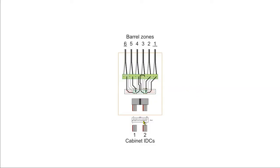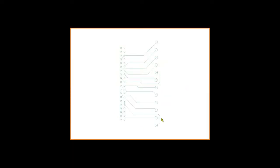Right, this is basically what we've got. It's a couple of 6-way ribbon cables coming into a 20-way IDC header, because I haven't got anything smaller, and that will go on to a 40-way IDC socket, again because I haven't got anything smaller, and then 12 of these pins will simply break out over to this screw-down terminal block for the thermocouples. So these are all the pins and the connections between them,